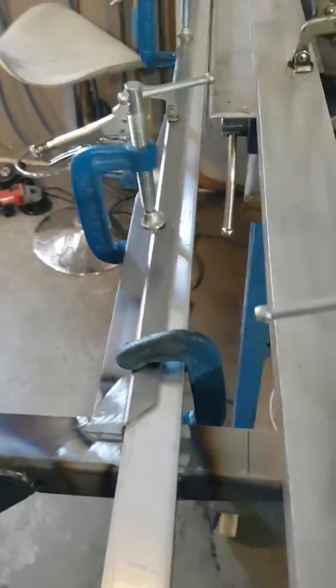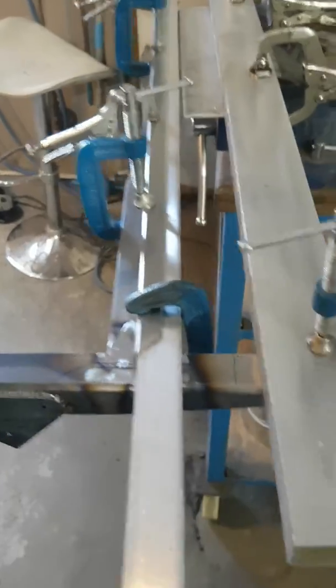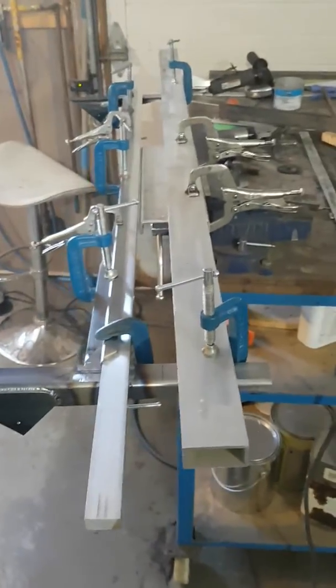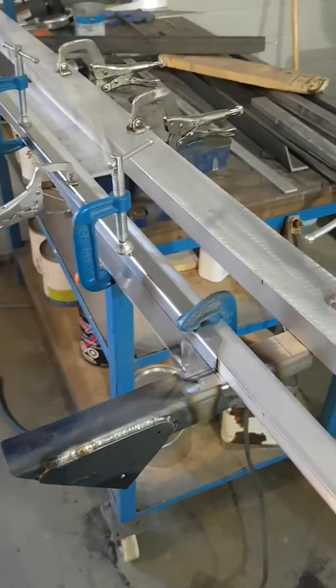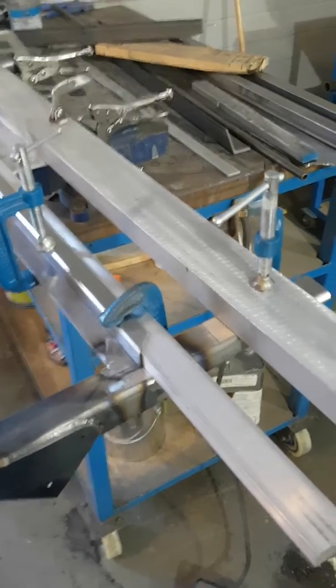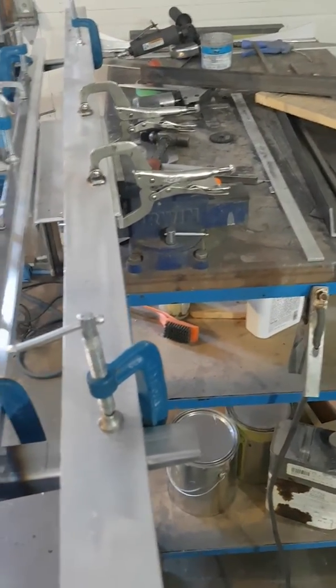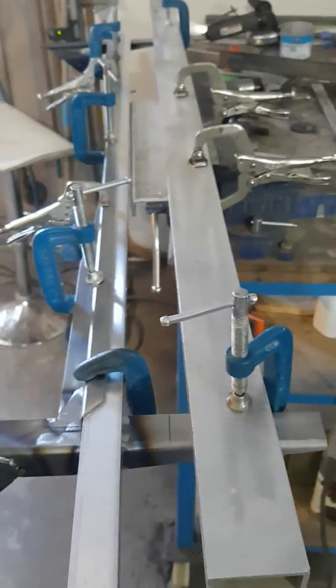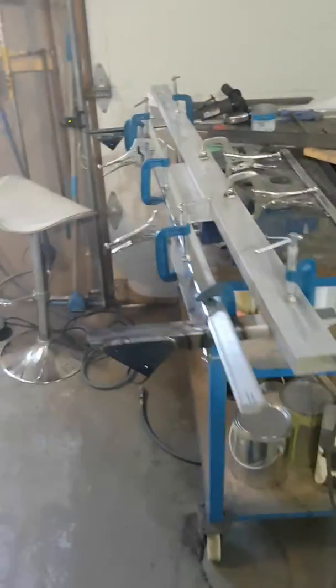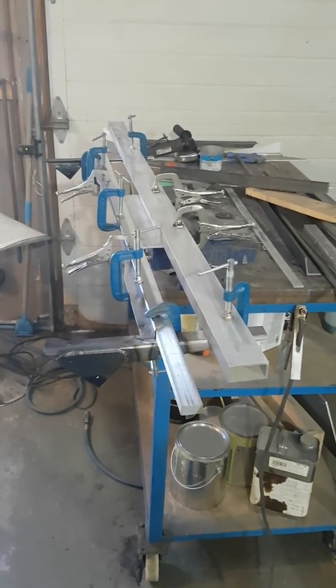Once that's all tacked in place I'll make the other components. I'll need to cut out another section of angle there and that'll tack up the sides. The windshield is going to sit down in that gutter and it will be bonded in with a standard urethane adhesive used for windshield bonding. It's going to sit a little bit proud on the top, probably by about two or three inches, just to cover my field of vision. Anyway, that's where I'm at and I will do my best to keep you apprised throughout the progress. Thanks for watching.